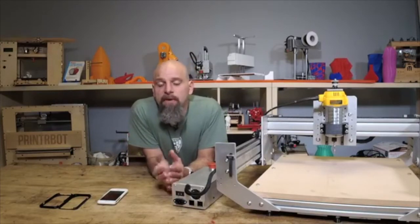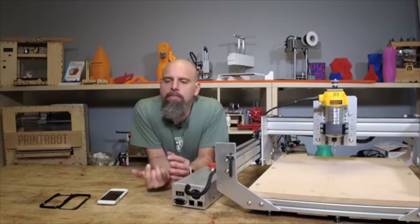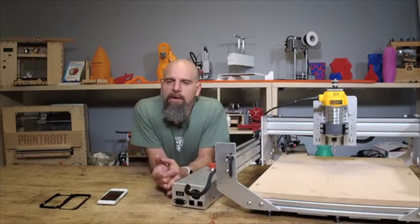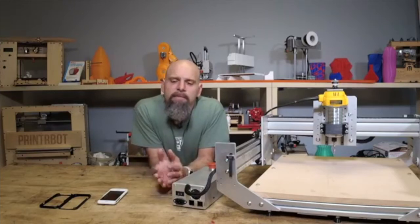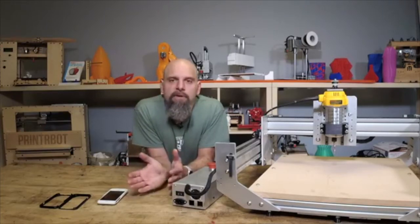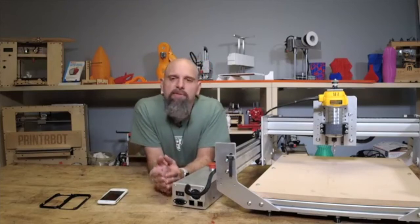Lightobjects.com, I think. They're actually local. They're in Sacramento, and I've been in their facility. They have some decent kits, but buy premium mirrors, buy premium lenses. They're not that much more. Do the upgrades. There's a whole community of people that take those 45-watt Chinese lasers, which are like $500 or less even. And there's a couple hundred dollars, maybe $300, of upgrades that you can do, and you can get a really nice functioning unit. A lot of people put the Tiny G board in there because it's really good with motion control. The boards that come with it you should throw away.